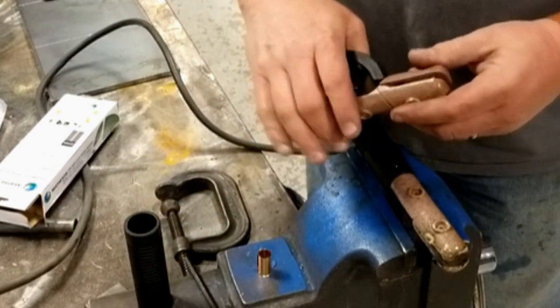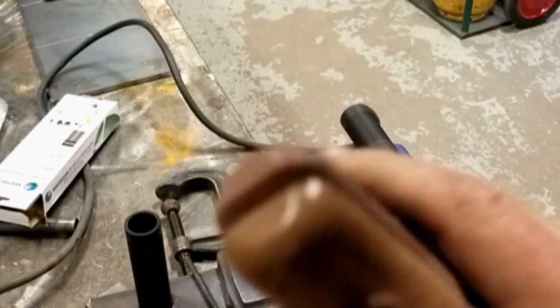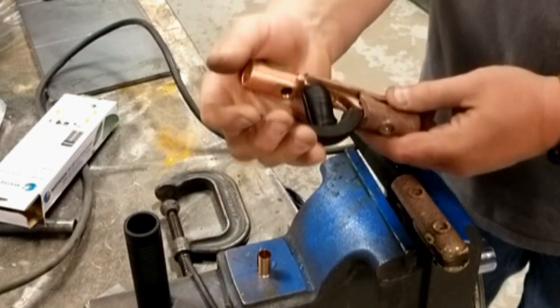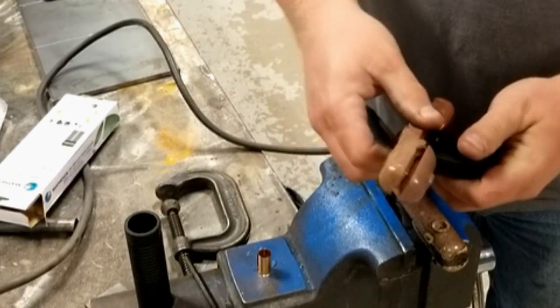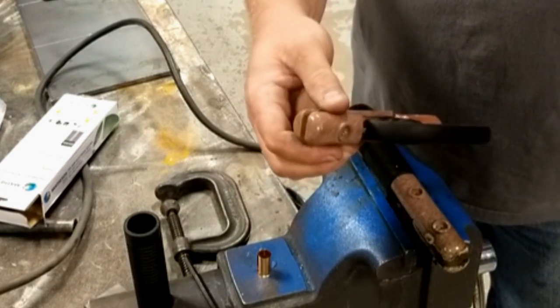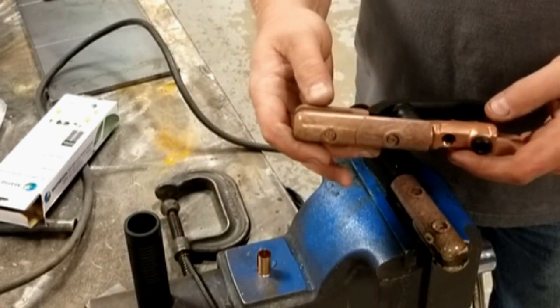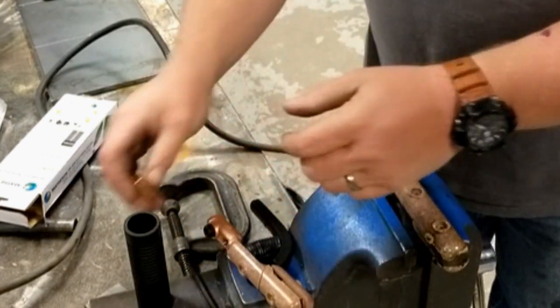Even though this is brand new and should be in good condition, let me bring this up to the camera with good lighting. These grooves are nice and sharp — they're really going to hold the electrode very, very well. The top side is generally flat in this case; some have just a metal laminated sheet in there. That's what they should look like. This should be pretty difficult to open — that should be fairly stout. Don't assume that because this just came out of the box that all these are tight. Give them a quick check to make sure the insulators are tight and none are broken — it could have fallen on the floor, only dropped once sort of thing.